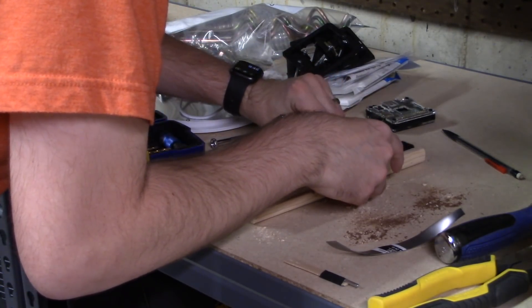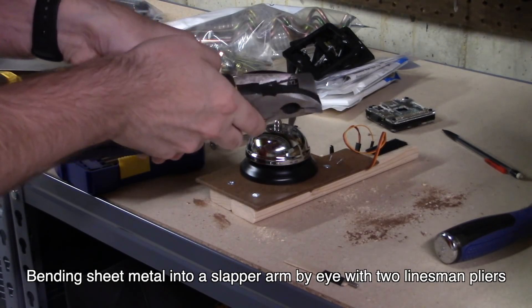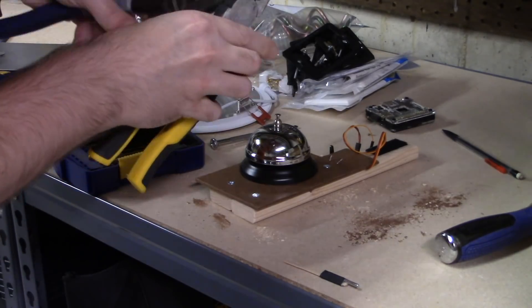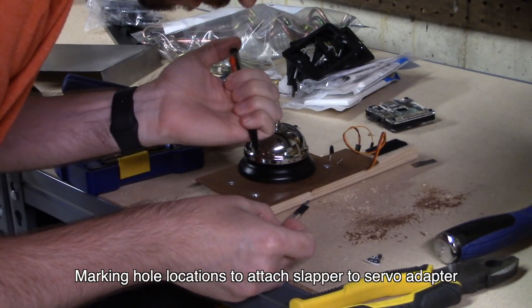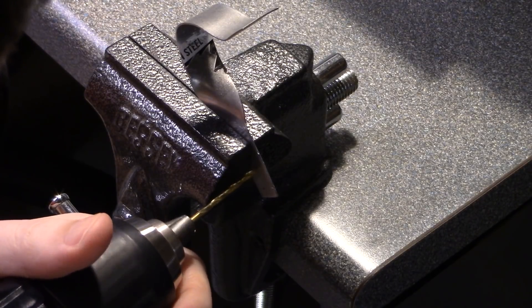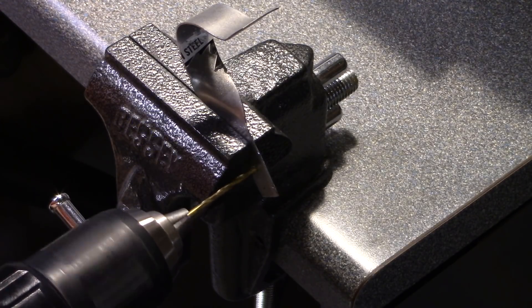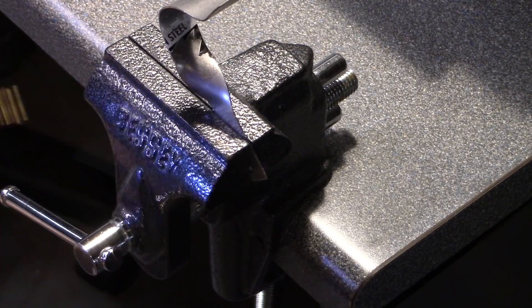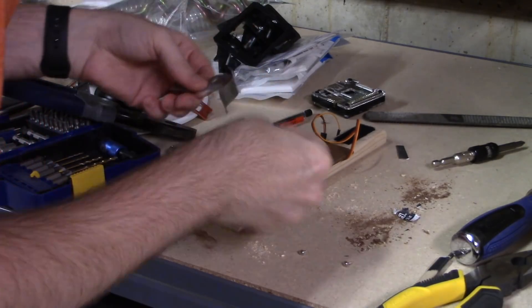This was late one night, the night before the last day of the Radiothon. I wanted to get it ready for the next morning so I could drop it off and they could use it. I'm using my linesman's pliers here just to bend a piece of sheet metal — I was trying to figure out how to get from a servo arm, which you can see as that little dot next to the orange wires, attached to a servo connected to the Pi, to slap the bell top. I cut a strip of sheet metal and made a way for it to attach, and was able to get the physical linkages all working so that the Pi could trigger the servo to hit it.